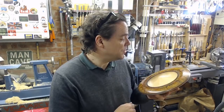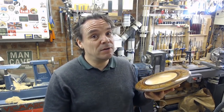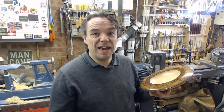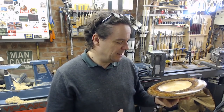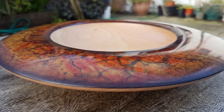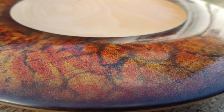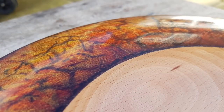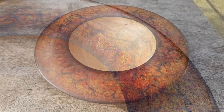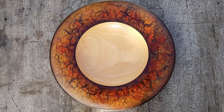The buffing has certainly raised the finish. If you look at some of the close-ups you'll see how the colour has drained away a bit — it moved when I put the sanding sealer on because I hadn't left it long enough to dry. Sometimes that's a deliberate choice and sometimes a mistake, but on this occasion I knew I hadn't left it long enough and it gives a sort of distressed look to the colours. Patience — that's not my middle name. Let me know what you think of it. Thanks for watching, commenting, and supporting my channel. I've noticed I've gone over five thousand subscribers — hip hip hooray — so there'll be some kind of giveaway coming up soon. Enjoy the rest of the video and I'll see you next time.